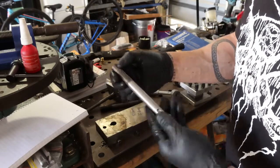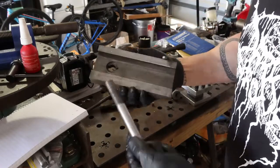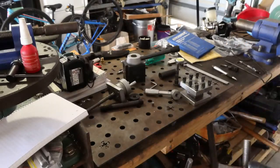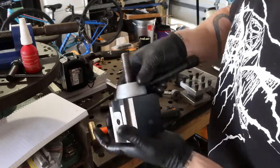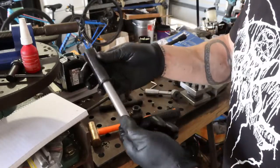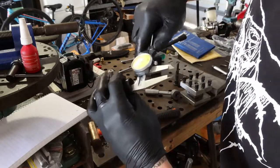What we have there with the key now on the ground is the original stud that I created for this thing. It came off a splined drive shaft, so it was hardened some of the way through — a bit of an odd material, I don't know what sort of steel it is, but it's what I had on hand. That slots on there nicely; it's a bit of a tight fit. The stud slides through there — it's a 16mm outer diameter with an M16x1.5mm thread on it. There's the registering sleeve, and there's a bit of wobble — that should be a registration surface. I want to create this tool post again.